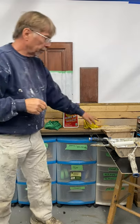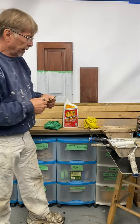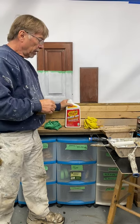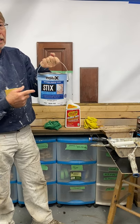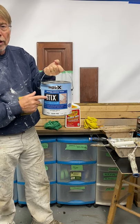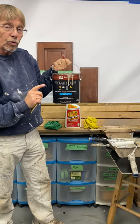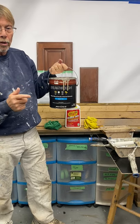Some of the tools you're going to need is 220 grit sandpaper. You're going to want a cleaning agent like Gloss Off by Crud Cutter — this allows the paint to bond to your surface. Then you're going to want a primer that will stick to your surface. There are many different ones; you can ask your paint store which one will bond to a cabinet finish. Then you want a finished coat of paint, and we prefer PPG's Breakthrough because it bonds really well and lays off really nice, so you don't see all the brush strokes or roller marks if you do it correctly.